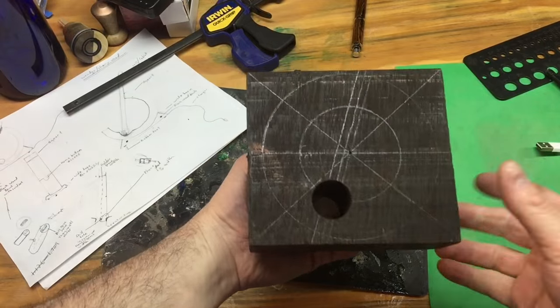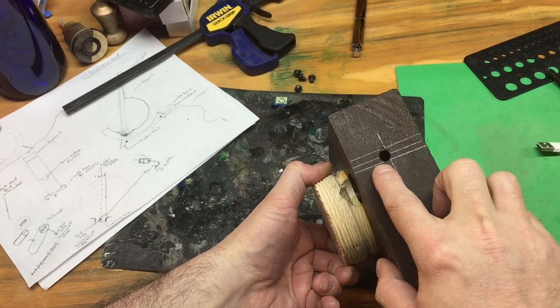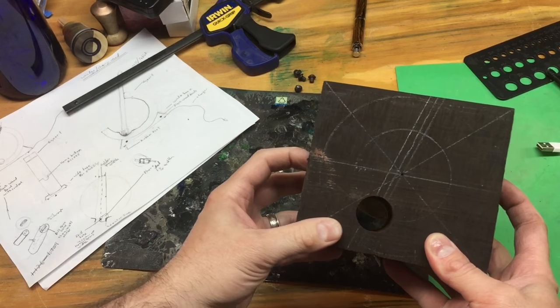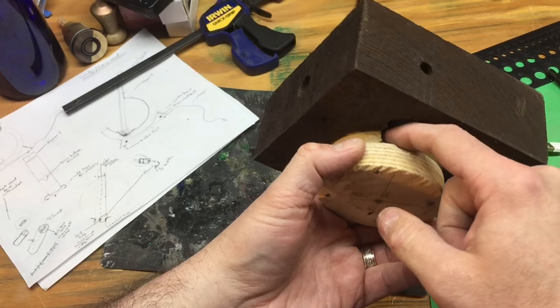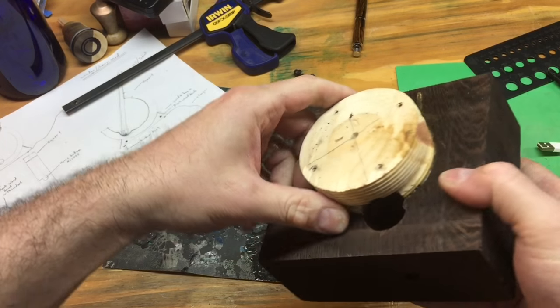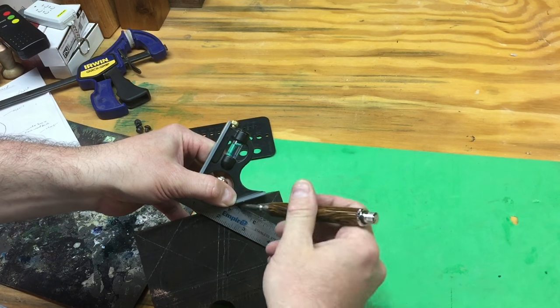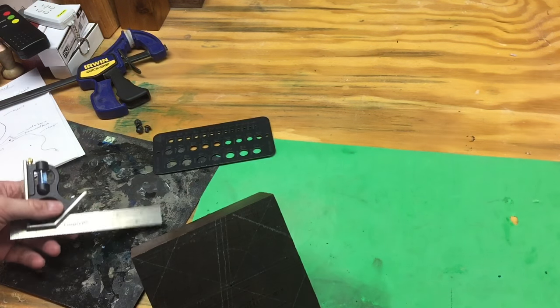And just to recap, there is a 1-inch through hole for a device rest, a 70 degree cord hole, and a 9/16 home button hole. Also a note that the 1-inch drill bit went through the waste block a little bit, but that's not going to interfere with the faceplate or the mounting screws. I don't believe it'll be a safety issue. And then I'm going to also cut down on the wood corners for safety and to salvage some of the wood.